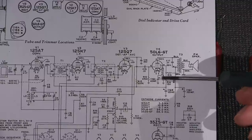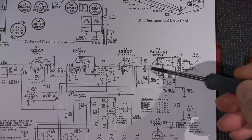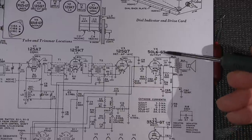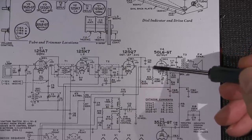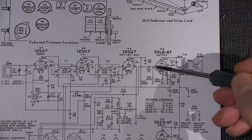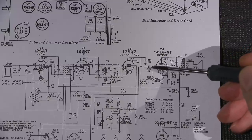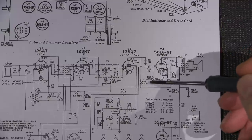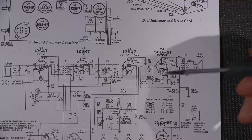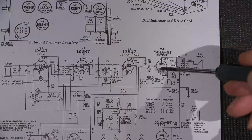Since this is lifted above ground, that looks like negative 5.5 volts on the control grid, all right? Because it's lifted above ground, so this looks negative. Negative 5.5 volts or very close to on pin number 5 here. So now here's the thing. If this capacitor is turning into a resistor, say the same value, that's a pretty high value, 470 k-ohms is, you know, getting up there, right? We're almost halfway to 1 megohm. So say we had 33 volts on this.